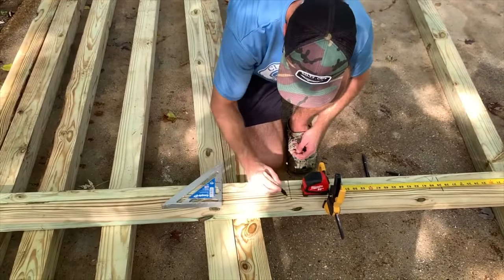And after installing all of the PVC conduit 12 inches below grade, it's time to 90 degree bend upward and come out through the ground and connect to the shed. So for my electrical conduit layout, I decided to route my conduit into the shed on the side near the front. So I drilled a 3/4 inch hole through, as you're seeing now. And just like before, I'm gonna use a tape measure to measure the distance I need to cover with the conduit.